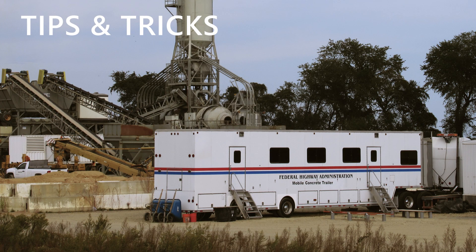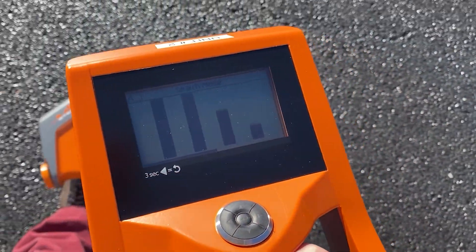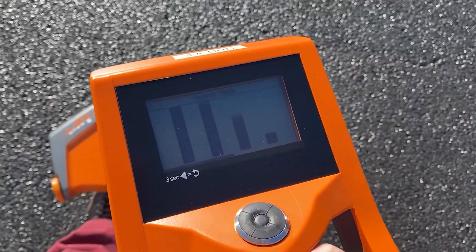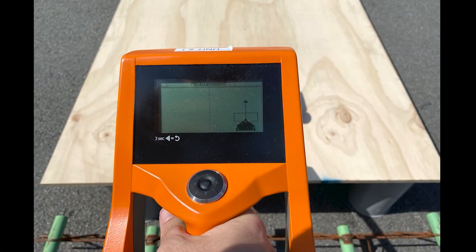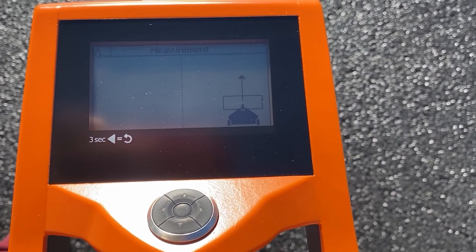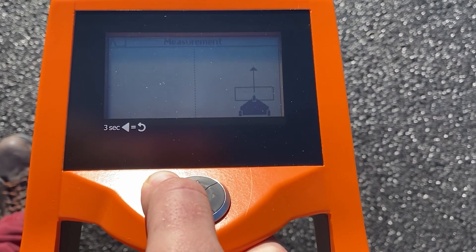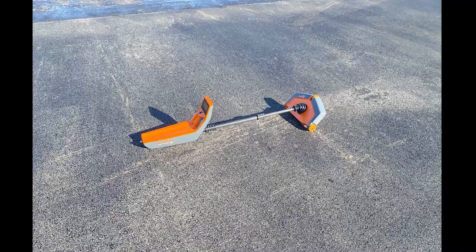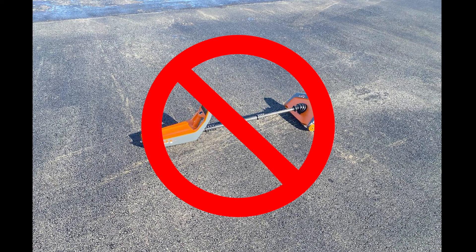There are a few tips and tricks we've picked up using this device in the field. Wearing steel-toed boots could interfere with the device's measurements. If at any point in the process of locating the reflector plate you accidentally bring up the measurement screen, simply hold the Back button for three seconds and then press the Enter button to continue locating the plate. When using the device, don't leave it out in the sun or in extreme weather for extended periods — the device is durable, but its electronics could be damaged by extended exposure.